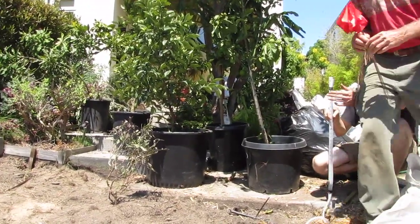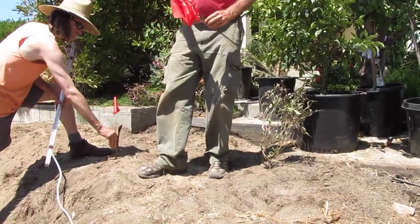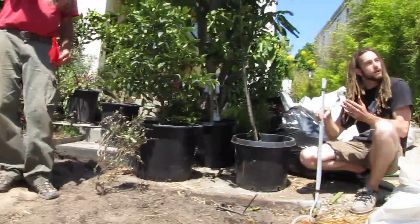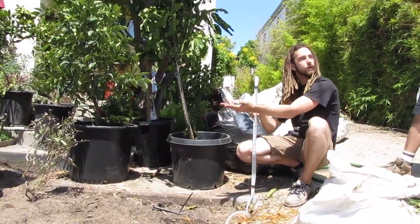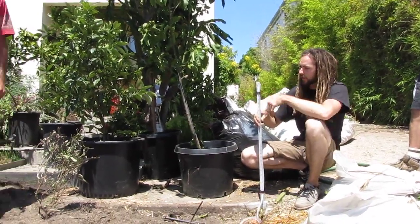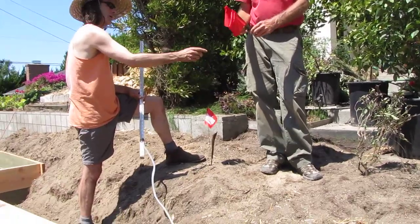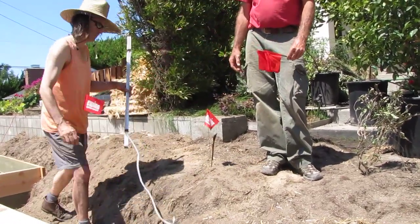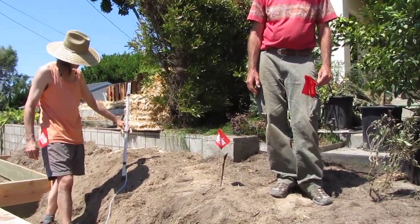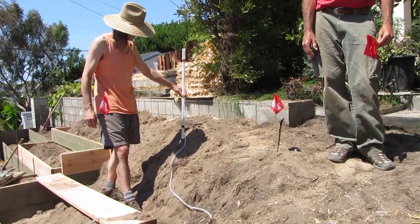We could do these terraced beds exactly on contour, following the contour line that naturally forms, or, because we have the versatility of being able to dig the soil, we could create the contour line where we want it, which is what we've been doing. So you've got it marked. Then just keep moving down, finding more slope. If you have the flexibility of deciding the slope, based on the current requirements, what kind of slope are you going to try to achieve?